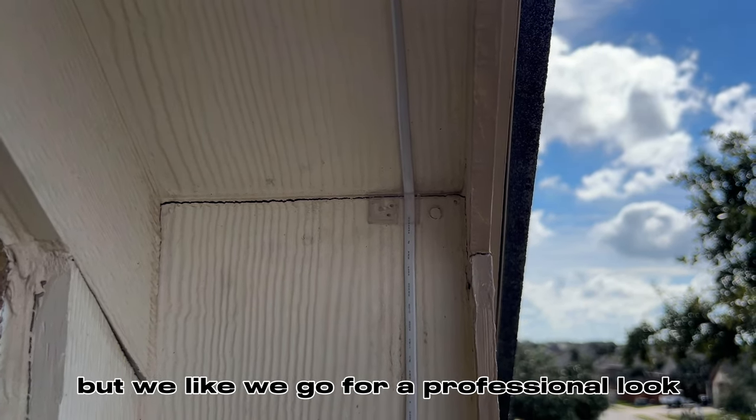All right, everyone, we ended up installing the Govee Pro lights. We got them installed over in that little back area as well. Here's the end result. Everything clipped, every light, two anchors, as described in all my Govee videos. Like I'd mentioned, start your strands with the male end here. Power is running back that way. So that way you can have a 12-foot jump here, go up and there. I had to cut it tight there in that corner because of the length to get to the side.